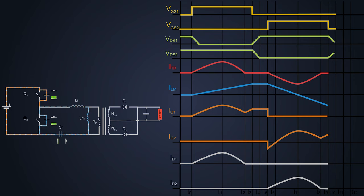The VDS of MOSFET Q2 increases as its parasitic capacitance charges up to the input voltage. The voltage across MOSFET Q1 goes to zero at time T10. The charging and discharging of the parasitic capacitances of MOSFET Q1 and Q2 is completed. But still, the magnetizing current wants to flow through the inductor as it still has some energy left in it, so the current will flow through the body diode of MOSFET Q1.